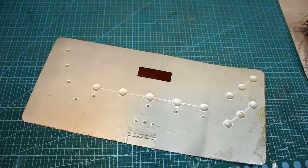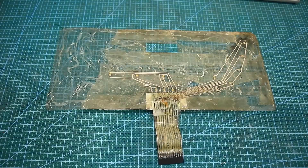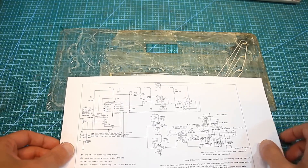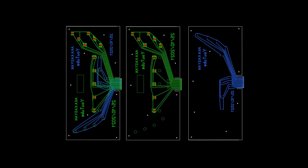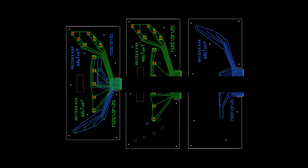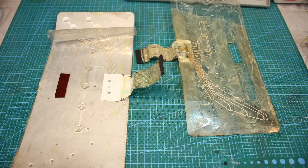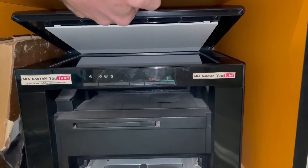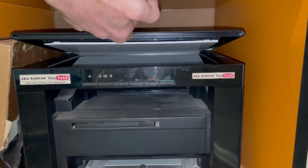The issue was that this panel is larger than a standard A4 sheet, and my printer — which was ultimately used to print the board — can only handle up to A4. I managed by deciding to cut the prototype into two A4 sheets, print them, and then glue them together. It's quite a challenge considering the board is double-sided. I also scanned it in parts, since the scanner also doesn't support anything larger than A4.